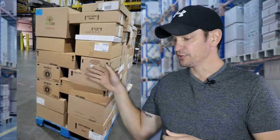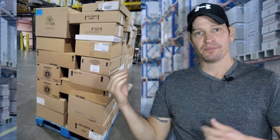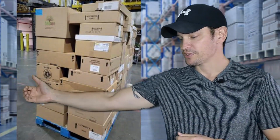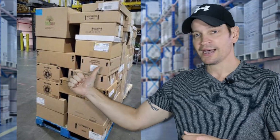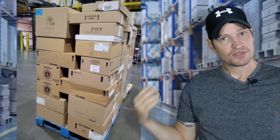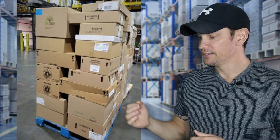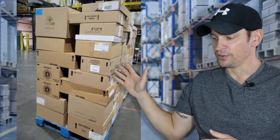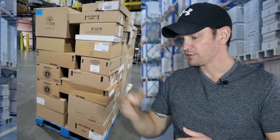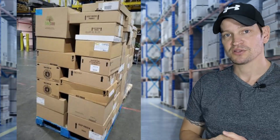As you can see right in the middle of this pallet here, the bigger, longer boxes, what did he do? He or she, I'm not even 100% sure who sent this, but they tied in the one side over here to this side. So that is very nicely done. So if you're building these type of products, this is how you want to do it. Bigger boxes that don't match up, columns, tie in when possible. So let's look at the next pic.